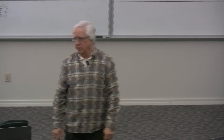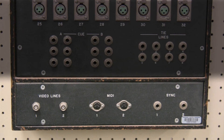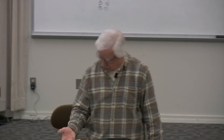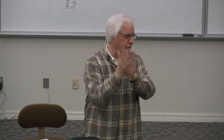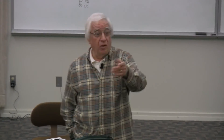Now, the bottom part of this panel is not hooked up yet. I've got two BNC cables on the left — those are video lines, one in and one out. Then I've got two MIDI cables, one in and one out. If someone with a MIDI rack wants to send me audio plus MIDI to lock Pro Tools with their MIDI time code, those two MIDI cables are there for that. Then there are two sync cables so I can send SMPTE time code from here into there, and on the second one from there into here. The plugs are in the panel — someday when I decide to hook them up, all I've got to do is hook it up.